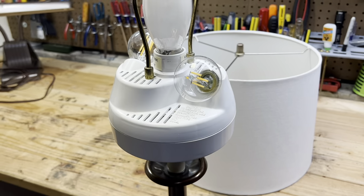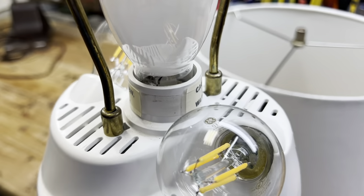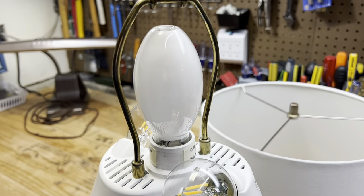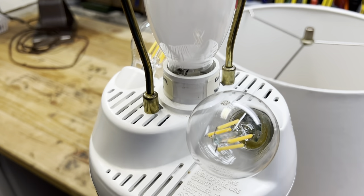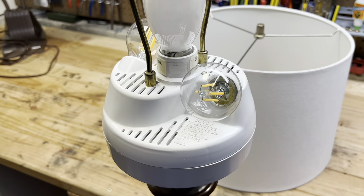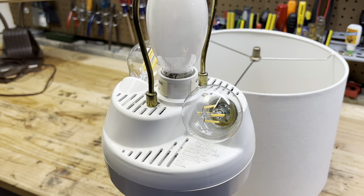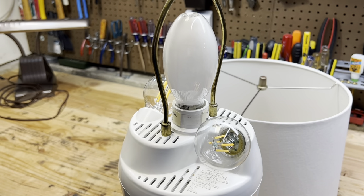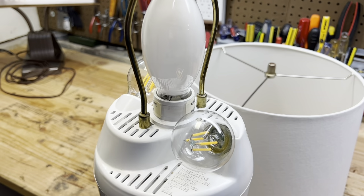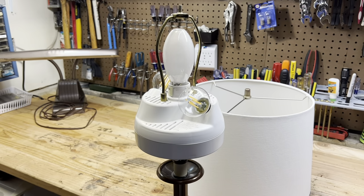Nothing really different on this side. One thing that is interesting to note is that this uses just the standard plastic base for the 68-watt metal halide bulb. The other versions that I've seen online and still on their website to this day use a standard pulse-rated ceramic socket, which you'd think would be needed here as well, but I'm not entirely sure. This must be one of the first models of their Micro Sun fixtures.